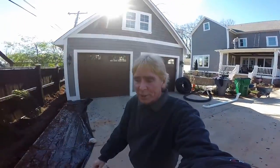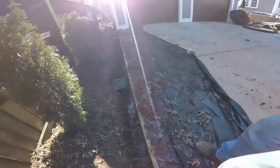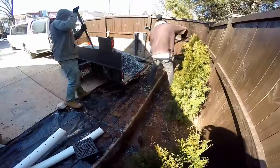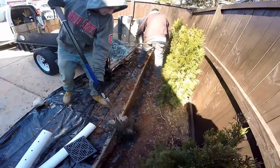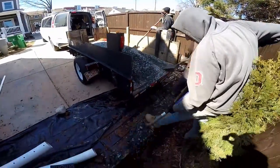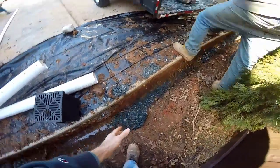While I was getting gravel, these guys have already put down the catch basins. They've got the trench dug out and you can see water collecting in there already. We're getting ready to fill up this trench with gravel — we're down about 20 inches and we've got a whole yard of gravel over there. We're going to put an entire base down here along the bottom, a good six inches of gravel at the bottom.